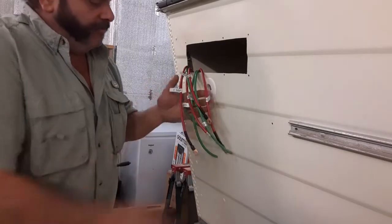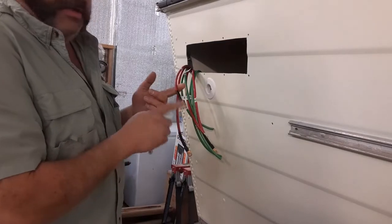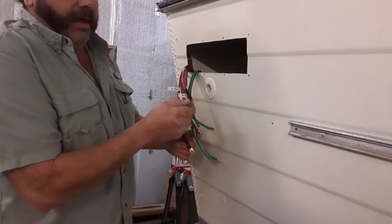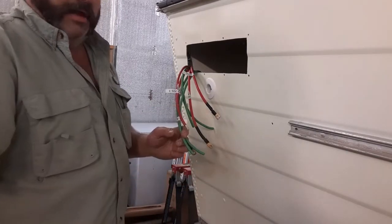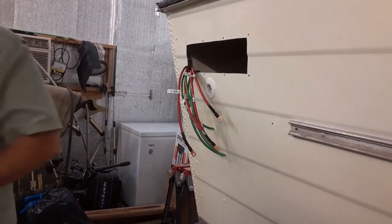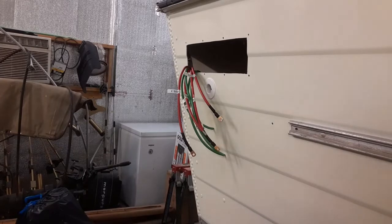Here are our bus lines we brought down the boat just a moment ago. I've been working on putting ends on each cable. The red wires are power — they go to each individual circuit breaker. The green ones, of course, go directly back to the battery negative terminal. So each one of the red wires gets an individual eyelet, and we will pair the grounds in twos and use a larger eyelet that will fit down on the marine battery post, which is the threaded post. I should show you this step — it's probably interesting to see. This eyelet is for eight gauge wire. I said six gauge earlier — I'm using eight gauge. I'm getting old.